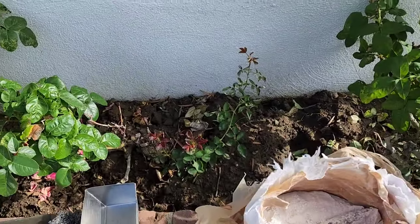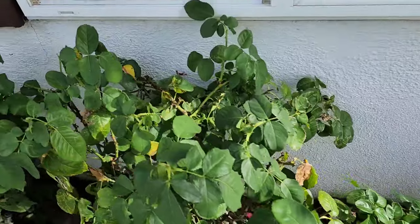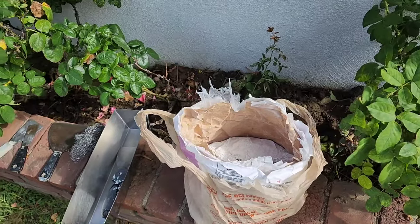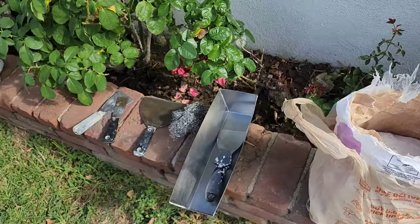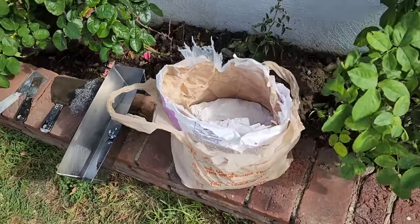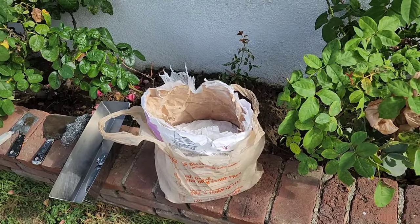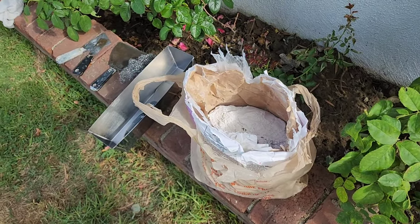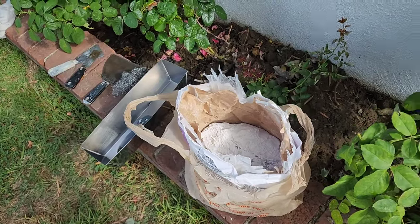We've done eight linear feet of some seams, and we still go back to that building years later, and there's no cracking. We only did it because we didn't have any mud, and we put it on just to fill the void, and it looked so good we decided to see what happens. There's been a lot of talk about Smooth Set on their website years ago, where they were bragging that you don't need tape. So far, it's held up. We do small patches without tape, and we still go back to those buildings years later, and they're beautiful. But just for the record, we do use tape.